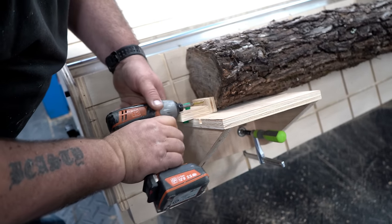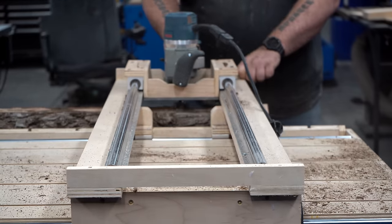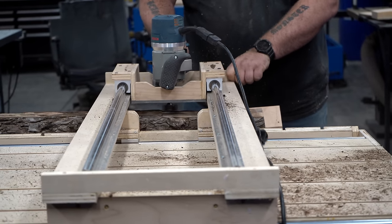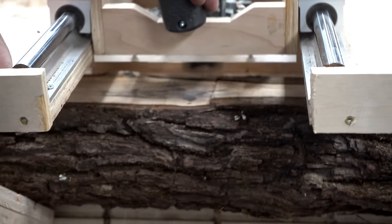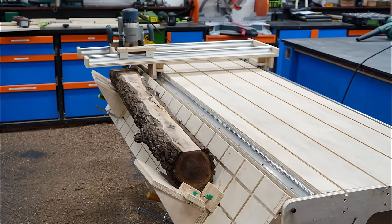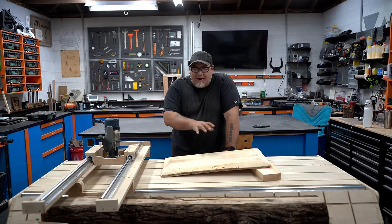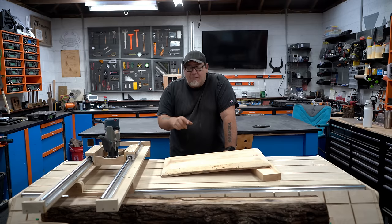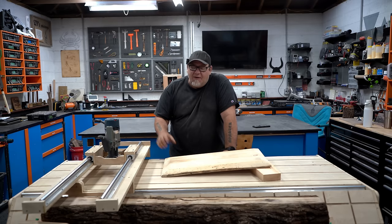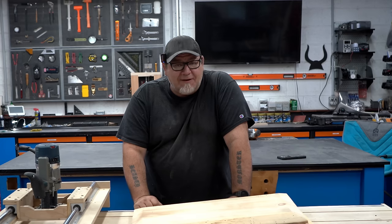Right now I'm using a Bosch with a slab flattening bit, and quite frankly that Bosch is a little underpowered for the bit I'm using, so I'm going to drop a 3-horsepower or more router into this system and test some different slab flattening bits — I'll show you the results in an upcoming video. I'm really curious what you are thinking about this system. Do you think it's a viable option for replacing a planer and a jointer in a small shop? What other things do you think I could pull off with this system? I'd really like to hear your feedback, so I'll be watching the comment section. Remember, like we said at the beginning, this is just a prototype and we've got a long way to go — we've got quite a few more fun things planned. If you want to see that, subscribe if you're not already, and come back next weekend when we'll have some really cool features to add to this and make it even more useful around the shop. As always, thank you for watching and we'll see you in the next video.